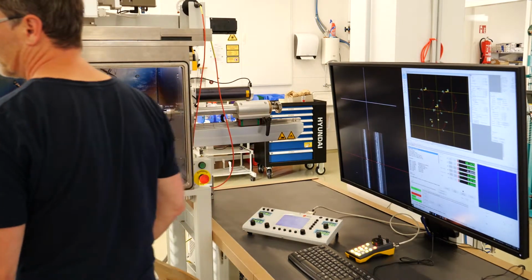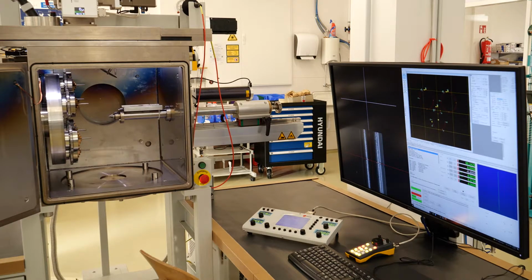You have this yellow colored item which does the CNC motion axis. So you can jog by using the dial button there and basically manipulate in different increments, fine adjustment, coarse adjustment. So you're able to travel the entire axis manually, or if you're handing over to the CNC control, CNC takes over and takes control.